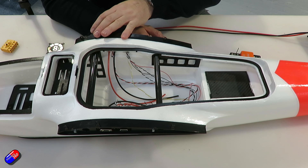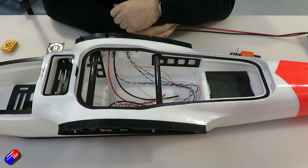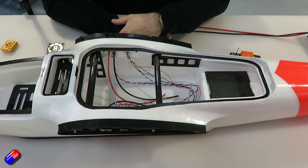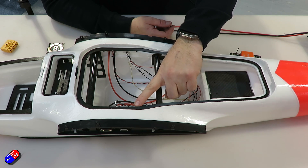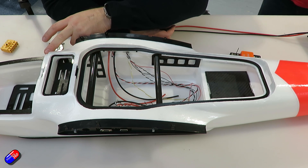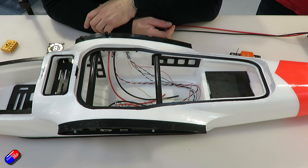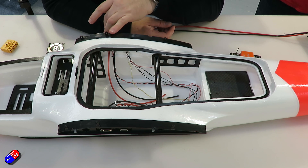We've also stuck on some of the initial plastics and stuck the body together — this comes in two halves, very nice fit with lots of locking and locating pins. There are a few fittings that go into recesses for parts to be screwed onto. We've got some reinforcing plates for the battery where the Velcro straps go through. In the comms bay there's a bit of wood. We've got the two centre spars and then the wing joins.